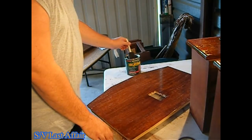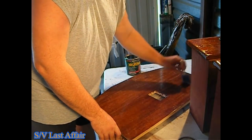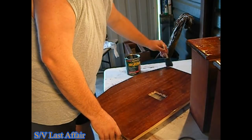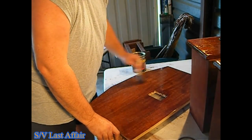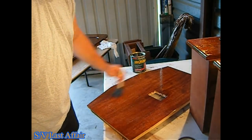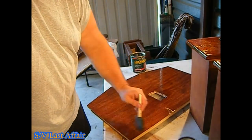I'm going to go ahead and varnish this piece as well — you can see it's sanded with some scuff marks. For a slightly larger piece, you want to start pretty liberal with the varnish as you put coating on, then spread it around and get the brush marks out. You'll notice I'm not always going with the grain — sometimes it's easier along the edges to go across the grain. As long as we smooth out the edges, it won't be an issue. You can see how those light spots from the sandpaper dust just go right away as soon as you put another coat on — so don't worry when you sand and start getting nervous about leaving a mark. You can always float in more varnish to correct that.